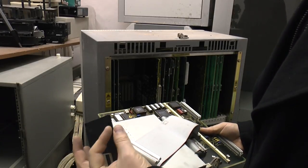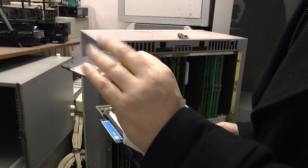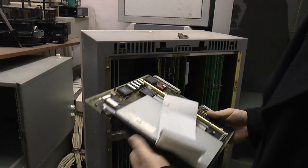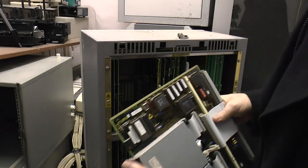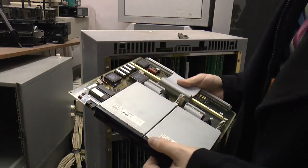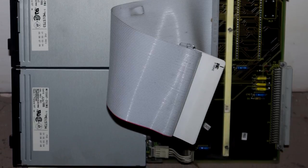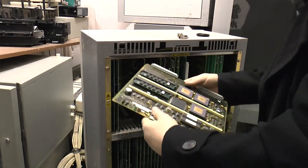This is the RISC loader circuit board. It uses a pair of extra-density floppy disks — you can see the hole is in a slightly different location, higher up than it is on the HD. These are four-megabyte unformatted disks; one will contain the program and the other will contain all the running software. I'll take a clear photograph of each board as I take them out, which I can then bring up on screen. And as you can see, that was plugged in to this board.